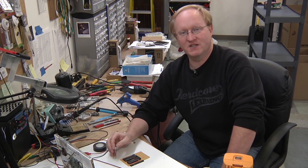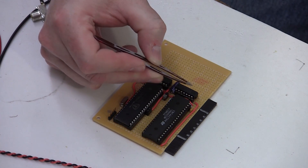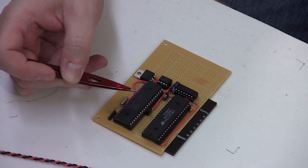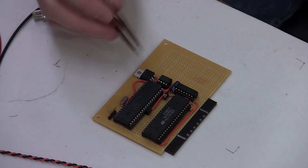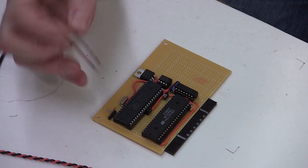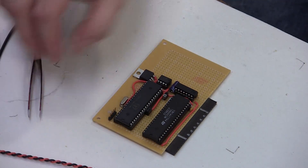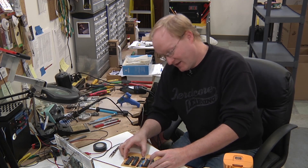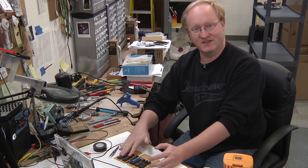The input-output portion of the circuit has been wired. We have the PIA — the peripheral interface adapter — a logic chip that goes with it, the Parallax Propeller microcontroller, and an EEPROM that will flash it on boot. This is a 3.3-volt regulator, the Propeller's crystal, a filtering capacitor, and the programming header. Just like the Spectrum, I made this in two halves that we can put together — basically CPU and I/O, just like the Spectrum.